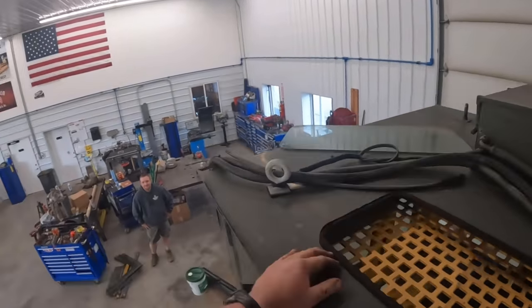All right, I got the return to dig rod off the top of the cylinder. You guys don't know what that means. There's actually a little valve in here. This rod has a divot in it, so when you dump that bucket, there's actually a detent in that lever. When you flip it back up, it will stick there. It will roll back the bucket to the return to dig position, and there's actually a little valve in there, and it'll click off.